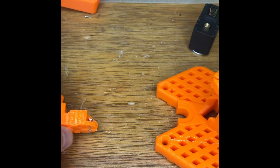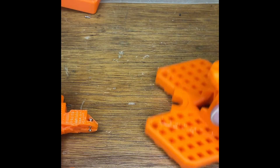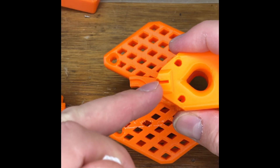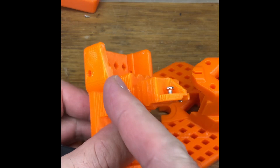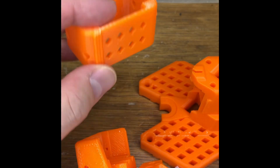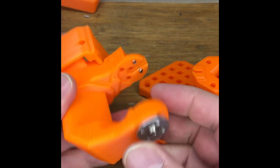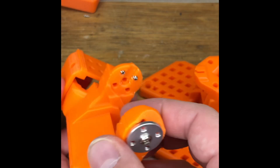The top end just goes on like normal. The last complication is of course the wires. One wire is going to pass back through this hole and one wire is going to come up here and then pass underneath the clamp. The clamp is marked with this raised boss to show you which way around it goes — you've got to see a gap there, that's where the wire comes out.